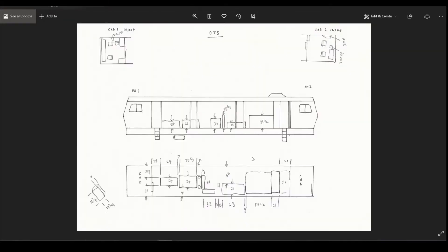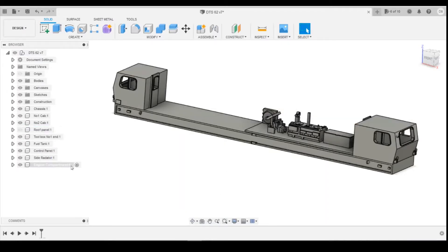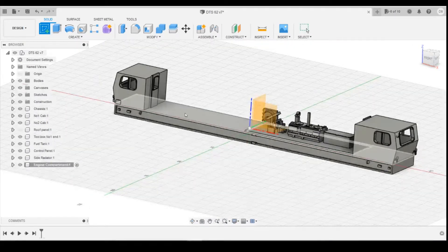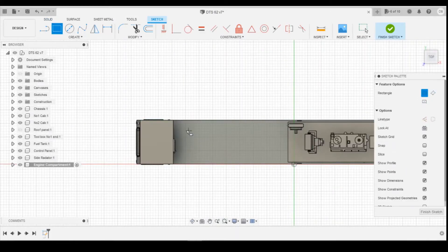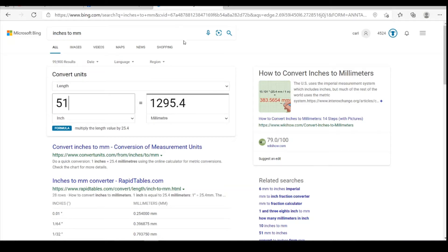If we have a look at the top-down plan, you can see that Paul's got the measurements here — 82.5 on this lower section, 22 on the bit that goes all the way up into the roof up here. We've also got a height of 39.5 inches. So we can start to draw that within Fusion. I'm going to start on this first rectangular part here. Let's turn the roof off and make sure we've got the engine compartment ticked. We create a sketch and use the floor of the chassis to create a sketch on. Looking at just creating a rectangle in the middle. So we've got 51 inches from the back of the cab to the back of this unit, which is also 51 inches wide. So 51 inches is 1295.4mm.